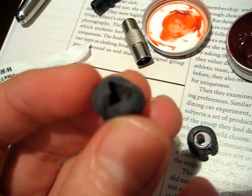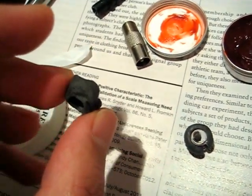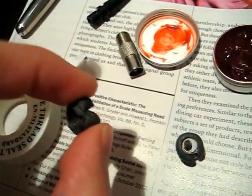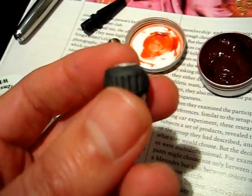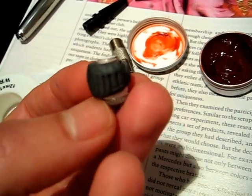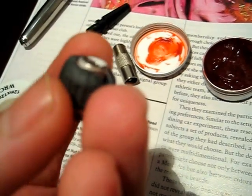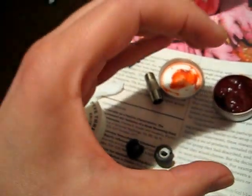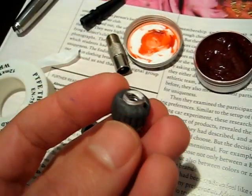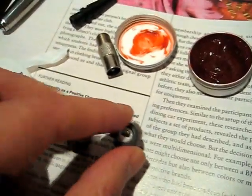The focus is lousy and so is the lighting, but take my word — this threads on quite well, really with no slop at all, and it does grip. With this one here, you can see I've also had a go at making an impression of the plier teeth, to see if that would give an even better grip when the spanner compresses on the thread. In the future, I might have a go at making one with a profile that matches my smooth section pliers as well.